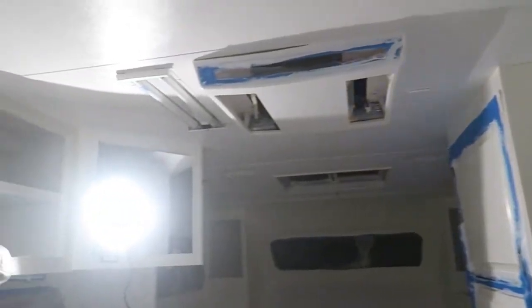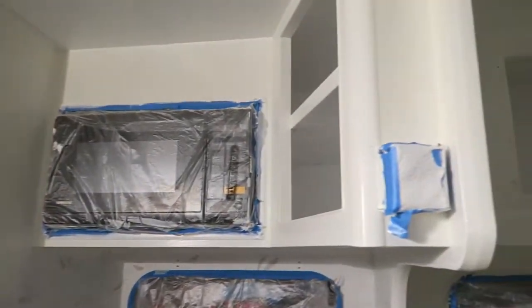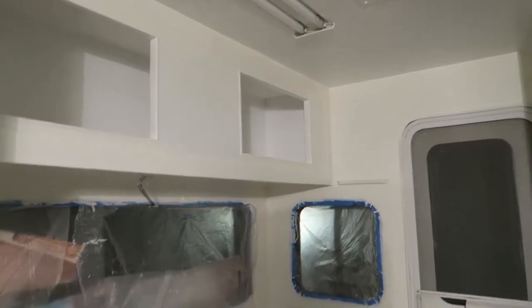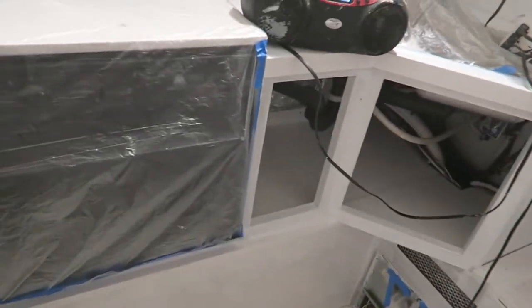I actually only did one coat on the upper cabinets so far, and technically it would be good to do a second coat so it doesn't drip on the bottom. But since the weather is getting cold, I want this first coat to dry out more for a few more days before I put the second coat on. So I'm just gonna do the first coat on the bottom. That's not the best way to do it, but I need to work with the weather because it's getting cold outside, so